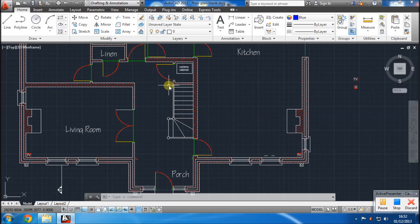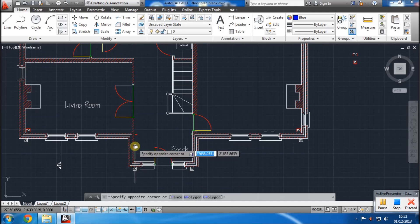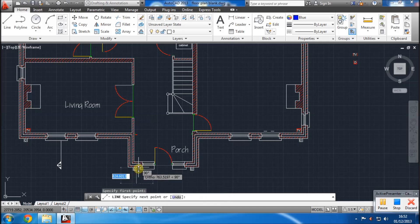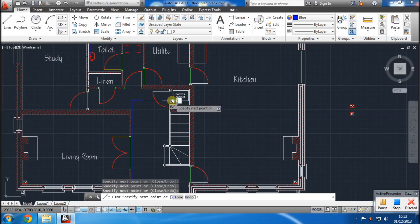You can use either Cat5, Cat5e, or Cat6 cable — I'll be doing another video showing the pros and cons of each. Today I'm just going to concentrate on the best way of wiring it. Your main incoming phone line will come from outside into a master socket, normally somewhere in the hallway. From there you want to take two or three Cat5e or Cat6 cables from this main telephone point up to your main comms room.